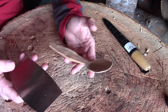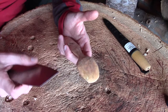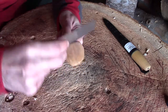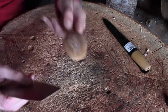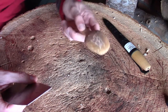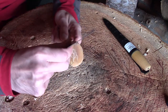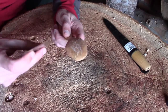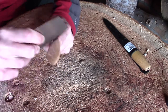So when I'm talking about the basics — same as when you're carving, a scraper will generally only work in the direction of the grain. On the back of my spoon here, I know I want to be going towards the tip and it runs very smoothly. If I try the other way, you can see it's kind of ripping up the back of the spoon, and that's what we don't want. If you're getting a lot of resistance and chattering, you're going the wrong way.